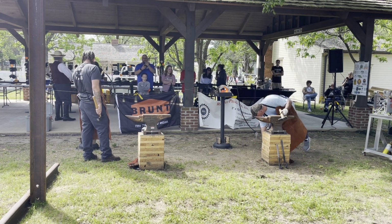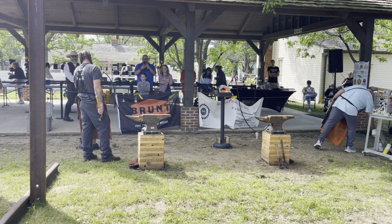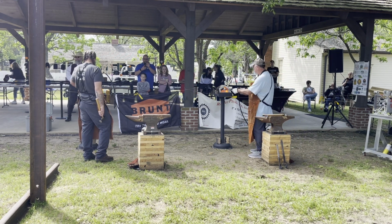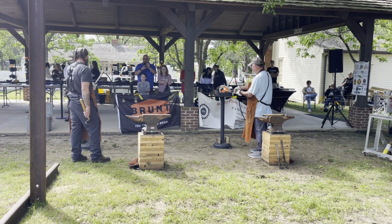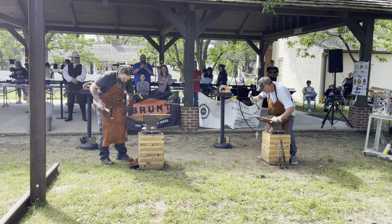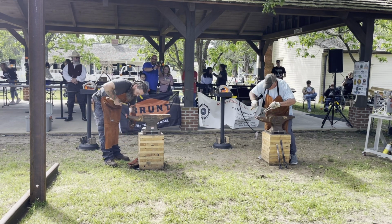Yeah, and that's one of the reasons why on Forged in Fire it's also hard, because we have a lot of studio lights to show what's going on. A typical forge isn't done in a bright place because you're always watching the temperature and the colors of your steel to make sure you don't burn up your steel. If you are outdoors in bright light, you might want to find a dark spot with shade, and that's sometimes an easier way to do it. Some people actually wear sunglasses too to help them.